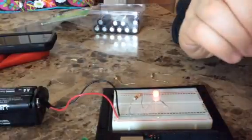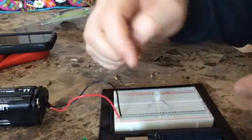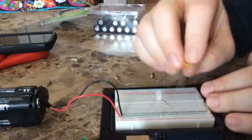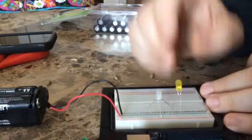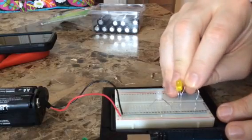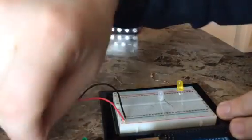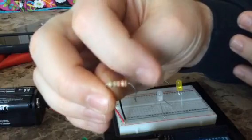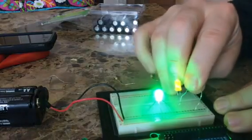What if I put two LEDs in series? I'm going to go from anode to cathode, then anode to cathode, and do it again — just using 680 because I know it's safe. They both turn on, but they're pretty weak, so I'm going to go down to a 220 — that's red, red, brown. And with 220, significantly brighter.